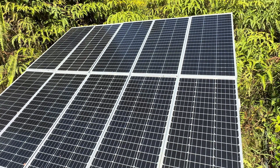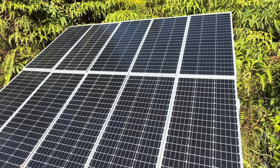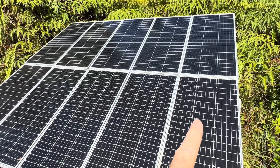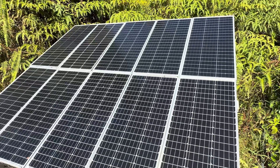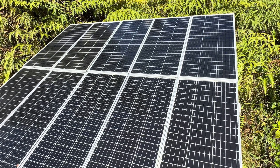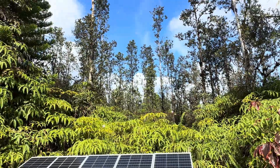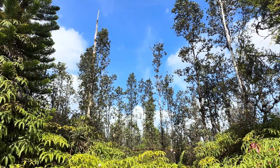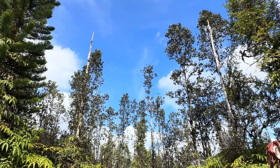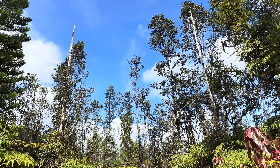Here's a good look right now in absolute full sunshine — the 1,000-watt array of panels going into those side-by-side Victron charge controllers in the back: 500 watts going to the top one, 500 to the bottom one. Under these conditions the panels are warming up, so they're not quite pushing 1,000 watts — close, but the warmer they get it drops a little. Under today's conditions, that Chins system will be 100% full. The good news is the sun starts coming back up in just a little over four to five weeks, so we're doing well this time of year — no gas needed.